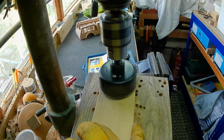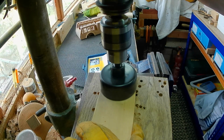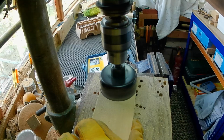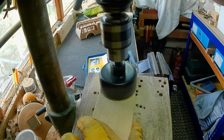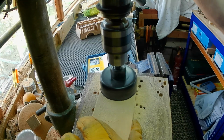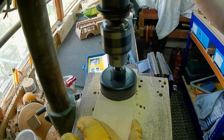Each of the 5 discs were cut out with a hole saw. It was the size of the saw that dictated the diameter of each disc. Cutting most of the way through from one side, then finishing from the other, made it easier to remove the disc from the saw.